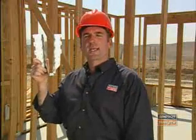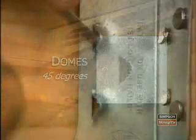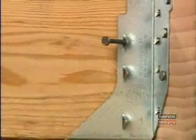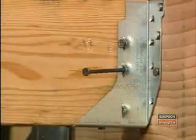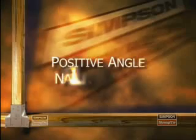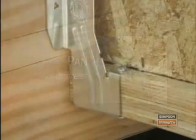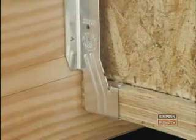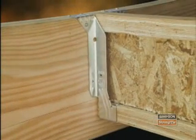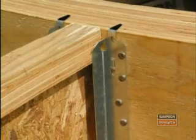Along with different hole shapes, Strong-Tie connectors use a variety of innovative design features to help secure connectors with greater efficiency and precision. The most common of these are the patented tabs and domes. Both features force the nail at a 45-degree angle, providing correct installation of our double-shear nail design and allowing for a simpler, faster, and stronger hanger installation. Simpson also uses this 45-degree feature with engineered wood product connectors, commonly known as I-joist hangers, referred to as PAN, or positive angle nailing, which forces the nail into the wood at a 45-degree angle, minimizing wood-splitting problems. Other I-joist hangers feature a bend tab that locks the hanger to the bottom cord of an I-joist, preventing joist movement and minimizing squeaks. Simpson's newest design, the IUS, features a snap-in seat requiring no joist nailing for the fastest possible installation and huge labor savings.